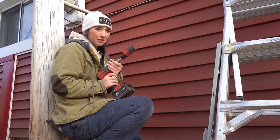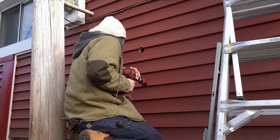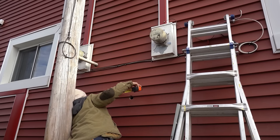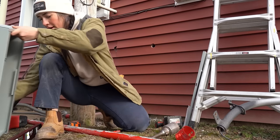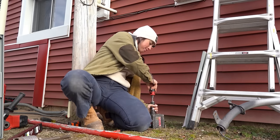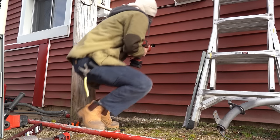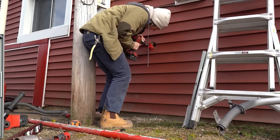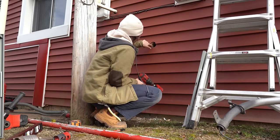For this run I skipped the other bit and went straight to this one. The Diablo bits are really strong for hole saws, and I always go backwards with very fragile stuff like vinyl that can crack or sheetrock. The two inch Carflex actually has a connector that is a lot thicker than the initial two inch, so I'm going to have to make the hole bigger on the vinyl side and on the concrete side. That way I can actually push the seal tight connector inside the vinyl and have it not poking out, so we can make the trough waterproof.